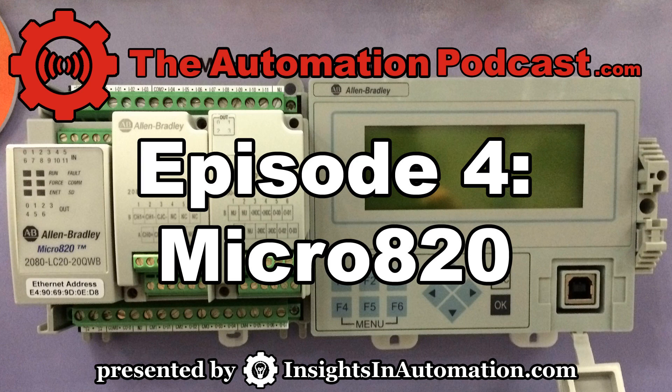Also releasing alongside the 820 is a new four-line text display. They were adamant to describe it as a four-line text display and not an HMI. The way you display things on this unit is by ASCII commands via the serial connection. It does have a four-color backlight, so if you had an alarm you could change the backlight to red. It also has some function keys and arrow keys on the front. However, you're going to be writing ASCII to read and write to this thing, so I don't know how user-friendly it's actually going to be.